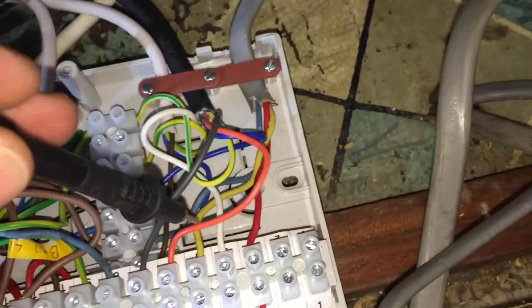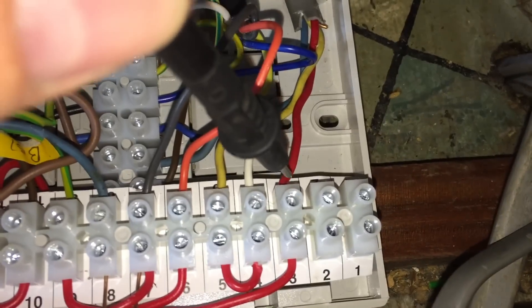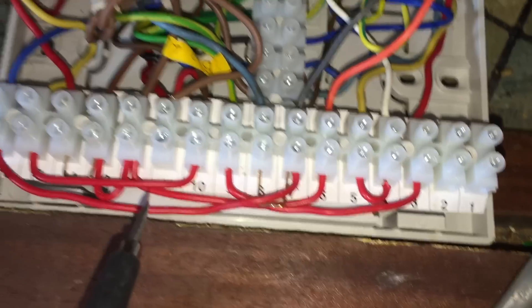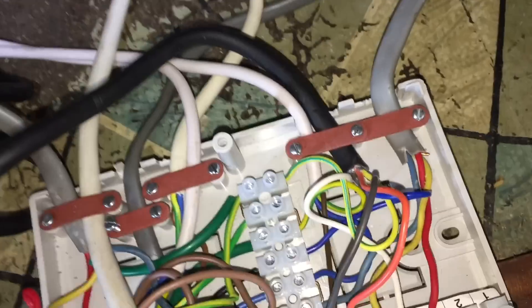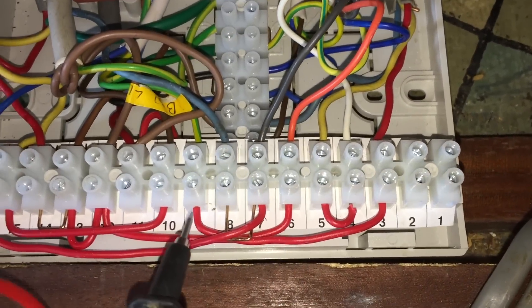It doesn't — probably because the room stat's off. So now we trace the white wire, which is here. Follow that — it's linked straight there to that yellow. So that yellow goes down there into that grey, runs off under the floor — that must be our room thermostat. The red of that grey wire goes in there. We'll follow that, and that most probably is going to go to the programmer. The red here comes across — that's it there, it goes in there.